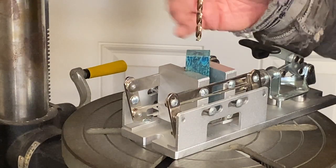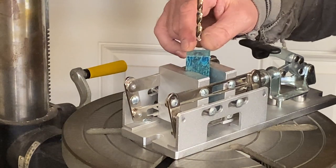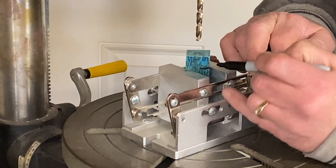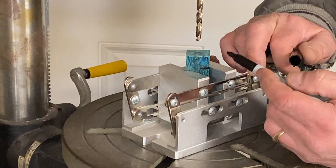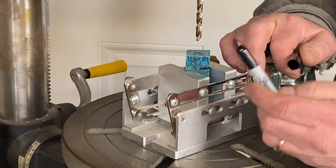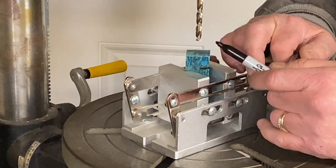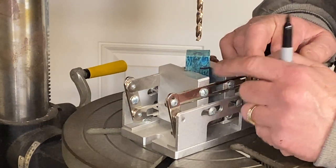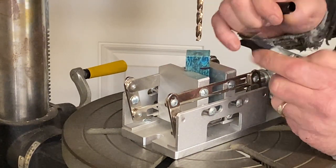I've got a quarter inch bit chucked up, marked at exactly 2.8 inches, which is the depth that we need to drill into this body blank. Using a magic marker, I'm going to make a registration mark on my blank. This mark is for when I'm making multiple pens at the same time — after I drill this quarter inch hole, I'll want to come back and drill a larger size hole, and I want to make sure I orient it in the same exact direction so that the bit follows the hole straight down into the blank.